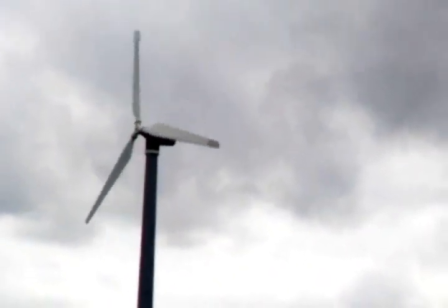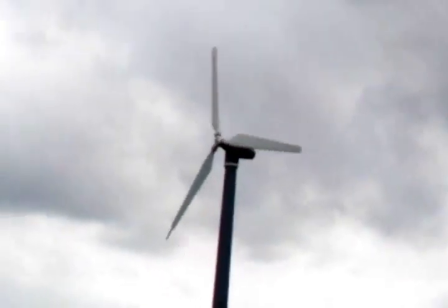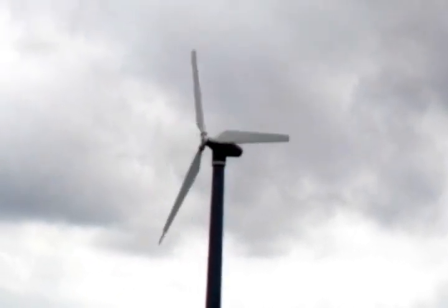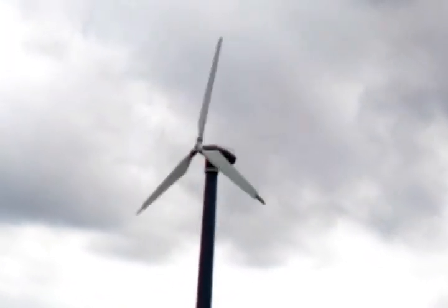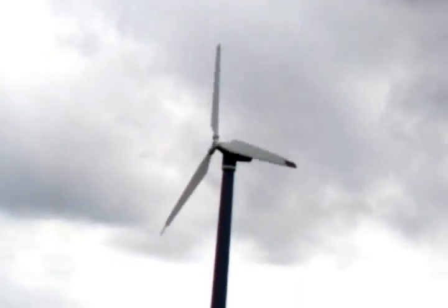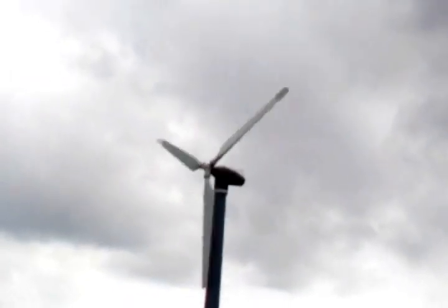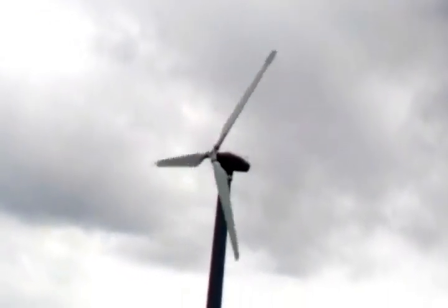Okay, Rory, do you want to yaw it 90 degrees out of the wind and pull a little so I won't be embarrassed and the tips will go in? We had some issues with the forces, with them deploying faster than 2,000 RPM on the high-speed shaft side, to where the forces would put a torque on the tips where even that won't get it to line up right, even though everything was configured properly. But we think we've got that resolved.